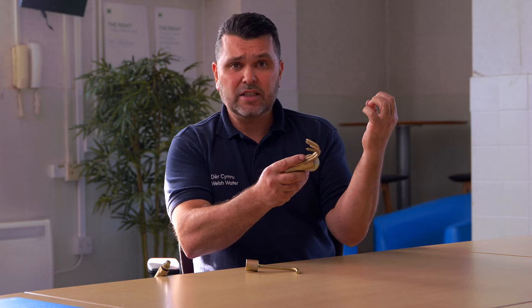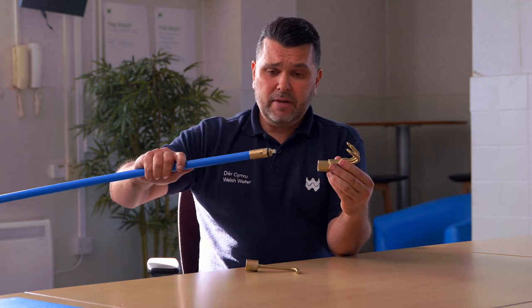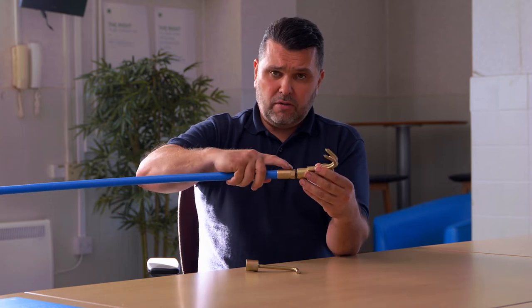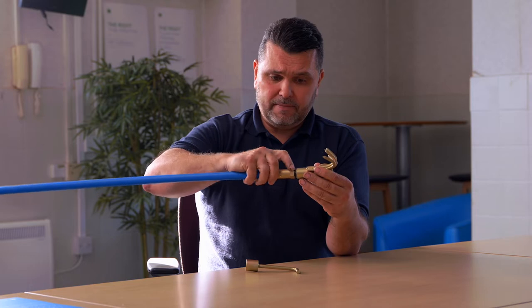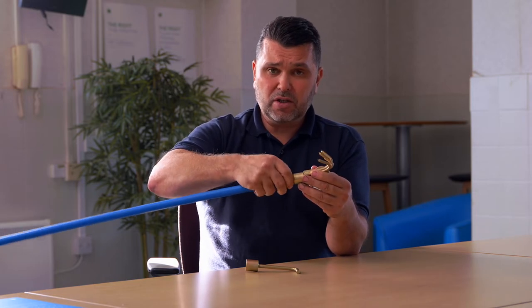You're not going to know exactly how far down the line the blockage is, but you'll know roughly how far down it is. You'd mount the claw, which was designed as if it was grabbing the wet wipes down the other end of the line. Use the retrieval rods from Bailey Products with the lockfast nuts and the grommet. Tighten them on with a spanner, not finger tight, because this will undo.